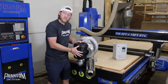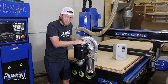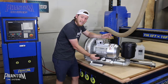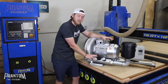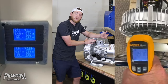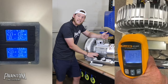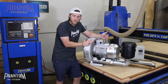Make sure that all these fittings are fairly tight. I like to have the canister filter perfectly vertical so that if there's ever any type of debris getting into it, everything settles to the bottom and you don't have any suction problems. Now these pumps are going to pull fresh air from the air intake regulator. The factory here in North Carolina runs every one of these vacuum pumps for 30 minutes and performs temperature tests, amperage pull tests, and suction tests. You don't ever want to mess with this intake because it's set at the factory for your specific pump to pull the correct amperage, heat load, and suction.